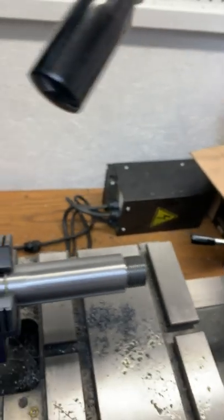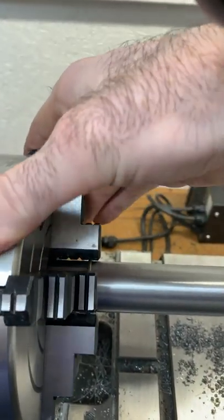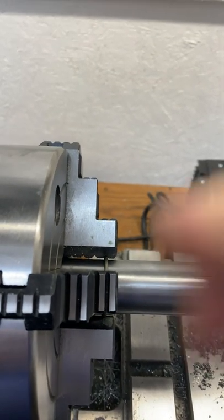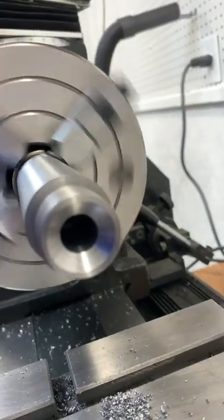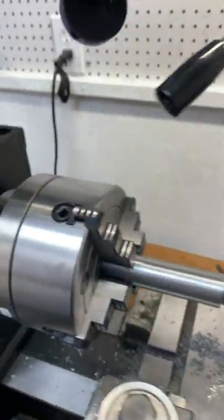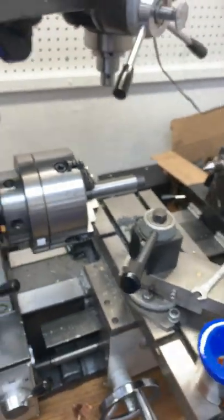There are definitely ways of doing things. Some people don't know this trick, some people do — you just put this nice little round wire in there, which gives you a pivot point. You can see the jaws themselves aren't touching the barrel; it's clamped down on that wire so it can pivot around. Turn this bad boy on — no runout, it's been perfect. Just a little video, and who knows, maybe that guy will see this. Until next time, I'll see you guys.